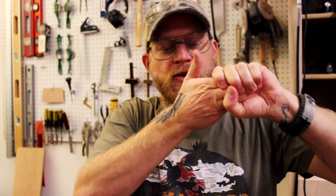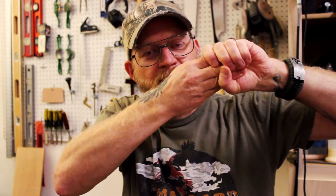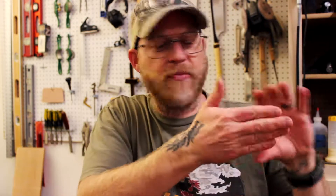Here's the deal: metal and wood don't mix — they're like oil and water. When metal interacts with wood, wood expands at a different rate than metal does, and metal is much harder than wood. So when the wood expands or contracts around that screw, it crushes onto the metal, but the metal resists. When the wood contracts back out, it has that indentation from the metal. With a threaded screw, the expansion and contraction of that wood over time loosens the screw up.